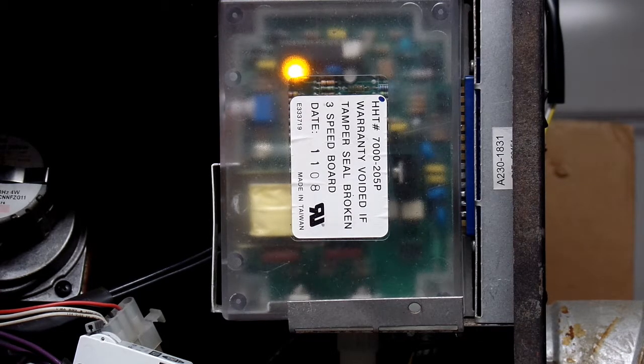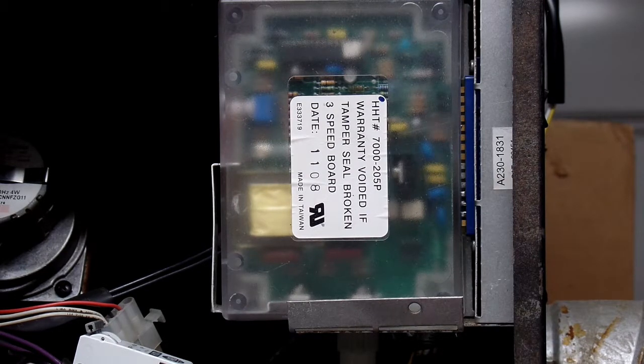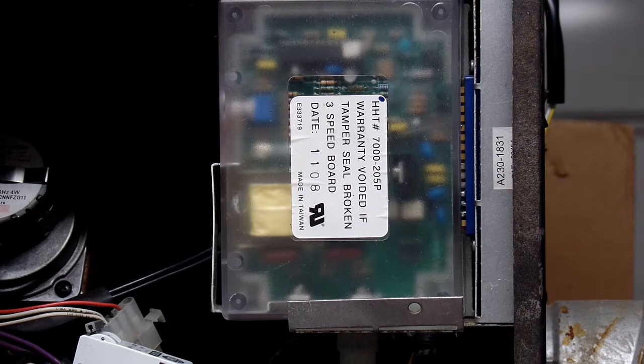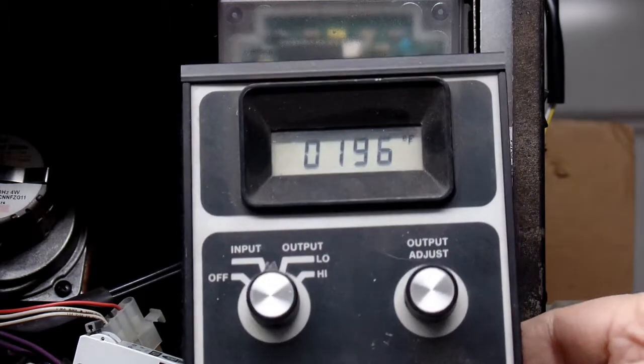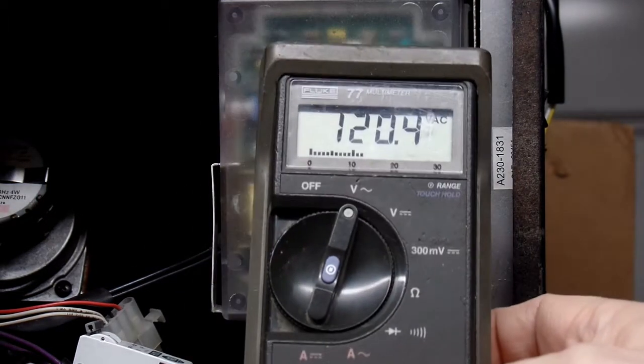So if you had called for heat, you have 120 volts AC going to the element, and the room is not yet hot because the fire hasn't started. Let's simulate that the temperature of the fire is starting to rise. We've gone through two minutes here, so the auger has gone off. As the temperature rises — I'm at 100 now — pretty soon my little light over here will turn green. So it's turned green, which means I'm at about 200 degrees Fahrenheit, and I'm still getting 120 volts to the heater element. As I turn up the temperature, this light will go red, and when that happens the voltage to the element will shut off.